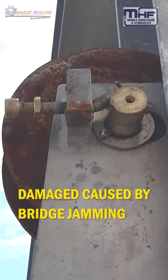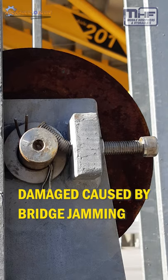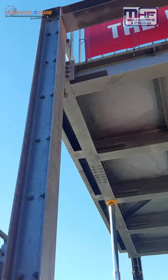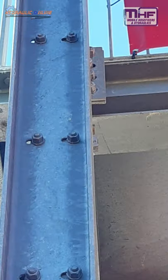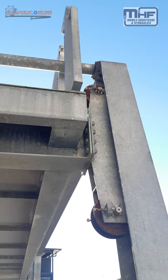This is some of the damage. These are adjustment bolts that are supposed to adjust the roller-to-column clearance. The columns actually have rails bolted to them, and most of these bolts were also loose, holding the rails to the columns. Here's the roller assembly that runs up and down the rails inside the column, and here's the actual rail itself inside the column that the rollers run on.